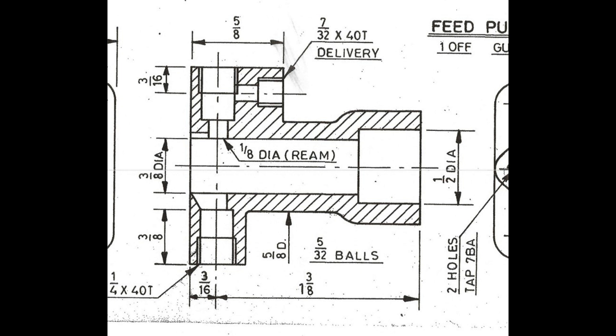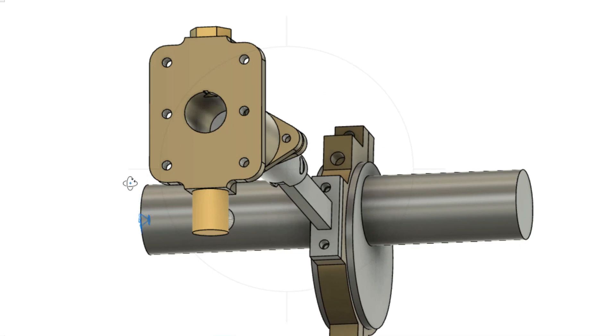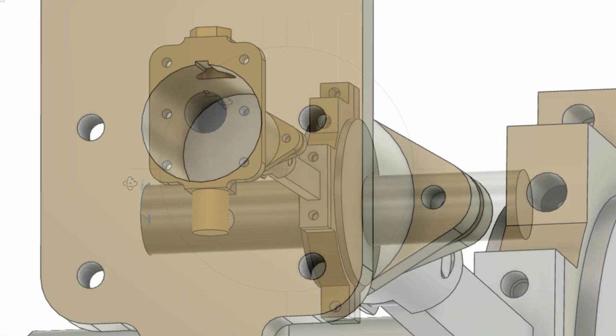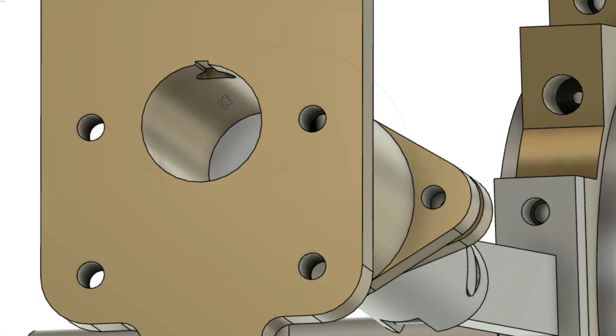Before I move on to the various parts that need to be attached to the pump body, a quick update on my last video where I asked about this little feature shown on Don's drawing. Thank you to Simon Holyfield who pointed out that this was a channel to allow water in the bore of the pump to exit via the outlet port should the ram extend that far. I checked with Fusion 360 and although the pump's ram does not block the outlet in normal use, the channel will prevent hydraulic lock should the ram ever be pushed that far into the body, which in turn should prevent the seal or gasket on the base from blowing. Thank you, Simon.